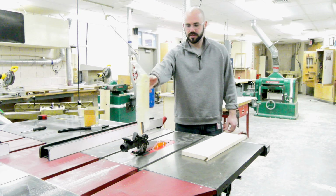Okay, and it's called a miter gauge because you have this T-slot which slips into the T-slot of the saw, but you have these miter angles which you can adjust the different angle depending upon what degree you need to cut at. We're just going to be cutting at 0 or 90 degrees. Okay, so I'm going to place my miter slot in one of my T-slots here. Okay, and the reason we remove the fence is we do not want friction to occur.